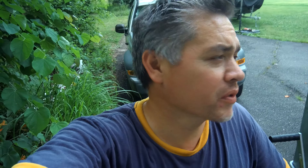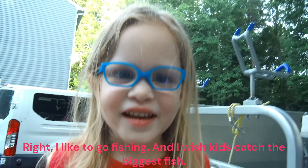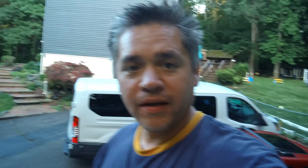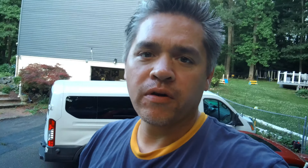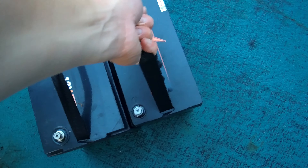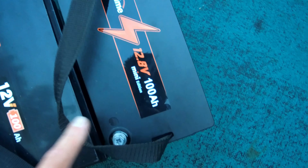I had to do a double spacer here. You can see right here — I've got two pieces of aluminum in there now. With the two pieces of aluminum, it's level with this; the whole board's level. I think that's the problem: if the puck's not level all the way from front to back, the holes don't line up — from the outer bracket to the inner bracket, none of that stuff is gonna line up. So it's gotta be level. I just happened to use some scrap aluminum sheets as my fix. More and more modifications — the things we do for some good old boating!